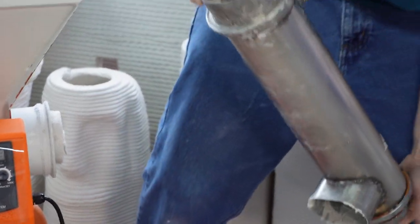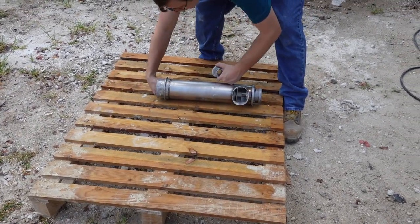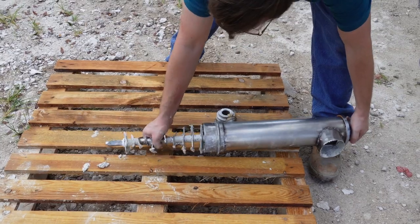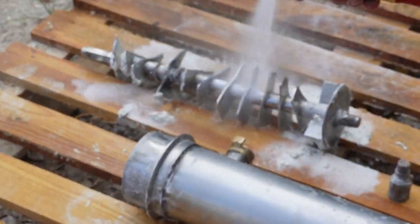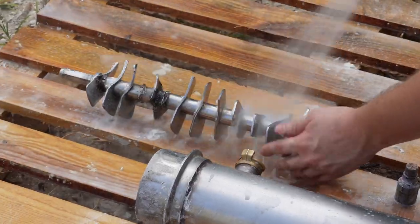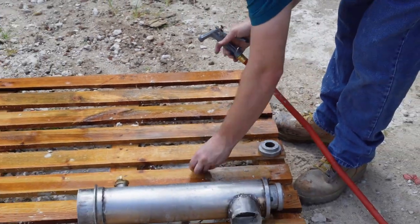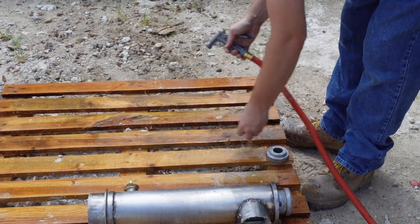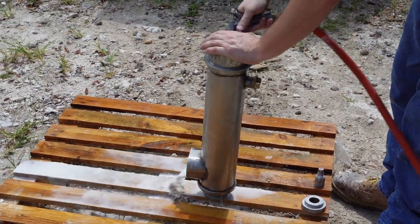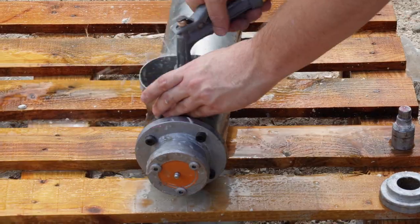Grab onto the mixing paddles and pull them off with the chamber if needed. On the inside of the mixing chamber at the end where the cement comes out, there is a bearing carrier and a blade stabilizer inside of it. These parts may come loose when removing the mixing blade. Take out the mixing blade — there should be a minimal amount of material on the blades. Use a water source to clean the blades; the material should come off easily. You can also use a pressure washer to clean the blades if one is available. Make sure the bearing carrier and the blade stabilizer are clean. If they are still inside the mixing chamber, they can remain there for about every four uses of the machine until they need to be taken out and thoroughly cleaned. Wash the inside of the mixing chamber until all material is removed. There can be small pockets of material at the end of the mixing chamber — make sure they are cleaned out.